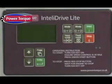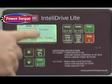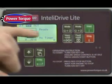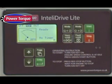Some more detail about the control panel and the IntelliDrive Lite controller. Turning the key on — you can hear the fuel pump buzz — we have the LCD display with a nice green backlight. As you can see, we have three modes: off, manual, and auto. It will always be in manual; that is one of the settings that is password locked, so you cannot change it. The only reason to change it would be if you have an auto start. You can see a 'Ready' indication showing we are ready to start, a tacho showing the true RPM, and a timer which we can set as a pre-start timer if required.